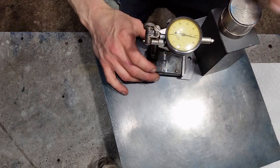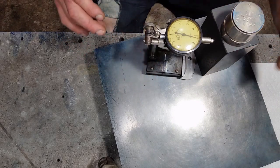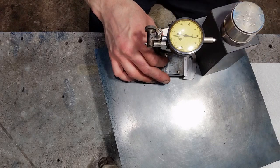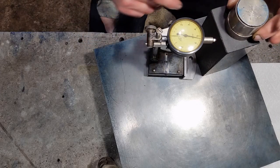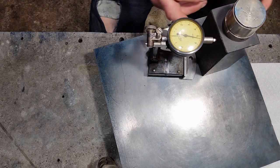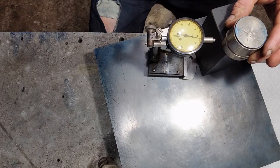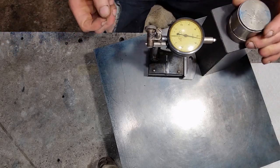I've been adding this weight to it on top for a couple of reasons. This tends to rotate, and I don't like touching it — I like having my hands off the table and only touching this, and that keeps it from rotating. Also, especially when I was working on the bottom face after having done the two sides, it was kind of irregular — I'd move this around and see if my readings changed at all. They did when it wasn't flat. Once I got flat, it really doesn't seem to affect it, which is good.